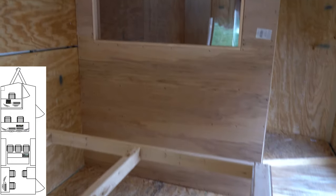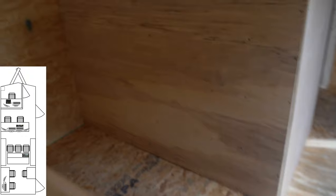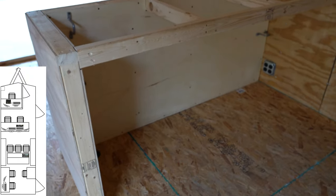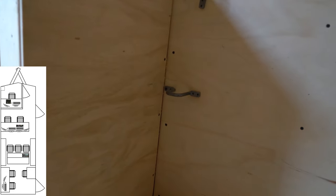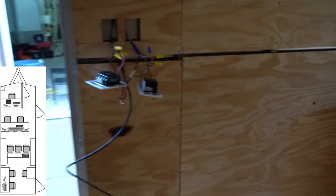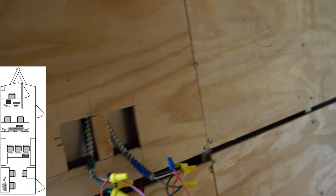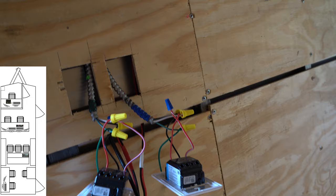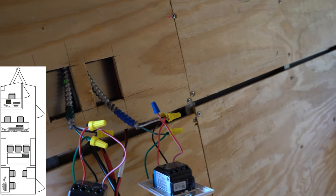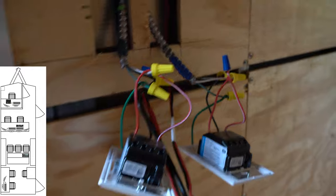The audio booth is completely framed out, so is the back row here. Walking over, we got the receptacles in, and some brackets that we're going to use to help maintain cable management. Over here we got the dimmers put in for the lights. I also have a line here — I ordered a two-toggle 12-volt switch which will be used for the external lights as well as the LED lights most likely. I'll show you the position for the external lights momentarily.